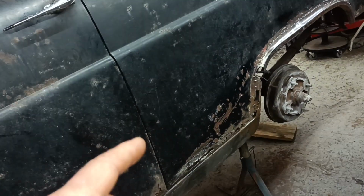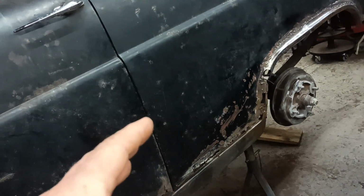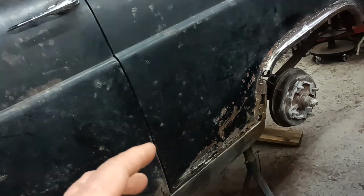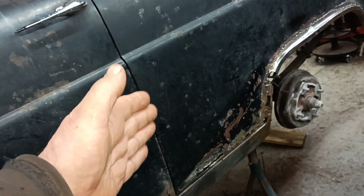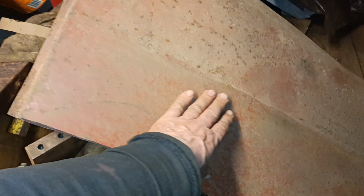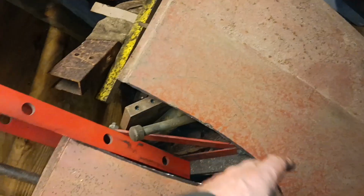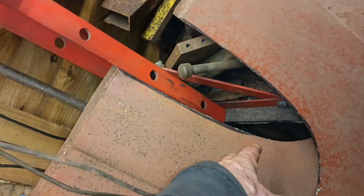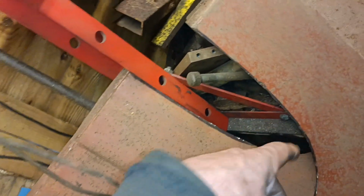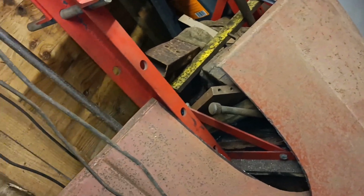My idea is to use a piece of metal from another part of the car. I want to use a piece of metal that already has a little bit of form in it. I'll show you what I'm thinking. I was thinking maybe this area here, like that. Now, the thing is, the welding that I'm doing using these patch panels that I've cut from here isn't going very well. I think it's because of all this old corrosion that's on these panels. Might not be, I just don't know. But I'll show you something else.